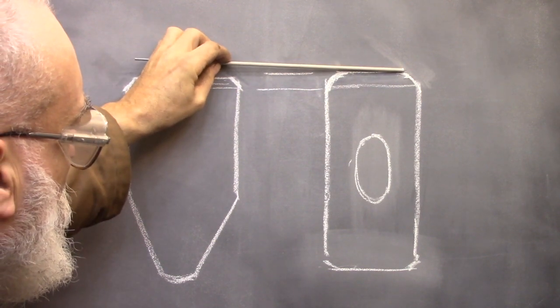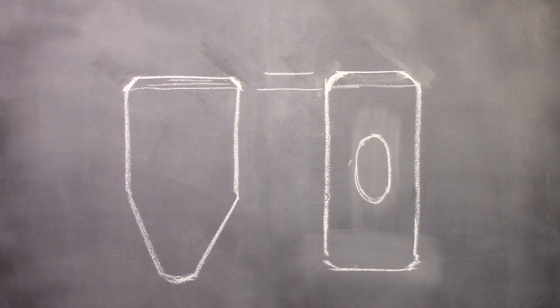You can see how much of the flat face that I'm losing on this view of the hammer. So if I don't want to be left with a tiny little square in the center of the hammer that's actually flat, I need to have that flat face run right from the front edge of the hammer to the back edge of the hammer. So that's the idea behind how I shape my forging hammers.